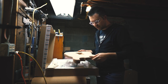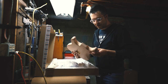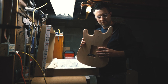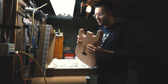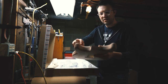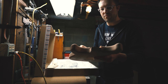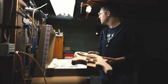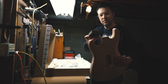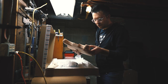And so we're gonna take this outside into the garage shop and sand this down with some 220 and really try and smooth it out, especially on the face. Little tip, of all the guitar bodies that I've gotten, the most difficult spots that really come rough sanded is right in these pockets right here. That's the part where you probably will spend the most time. If you have some kind of belt sander or even some blocks like these guys, this will go a long way to cleaning up inside those. And so we're going to start with the 220 and see how that goes.